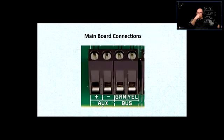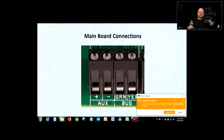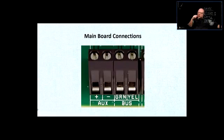Okay? Now, right beside that, how many devices can you put in? Well, you have to read the specs on the board to see how much current is available from this terminal, because it can only supply so much current before it starts getting funny on you, all right? Which would be lowering the voltage, and undesired things will be happening. So you have to read how much power this thing is able to provide, which will be the current capability or the ampacity of it.